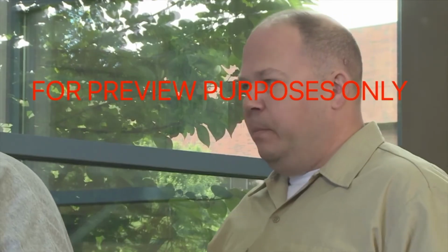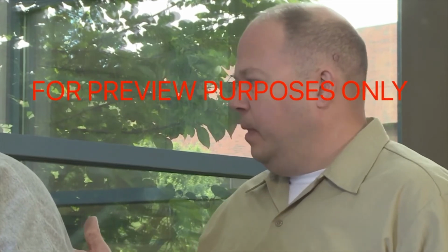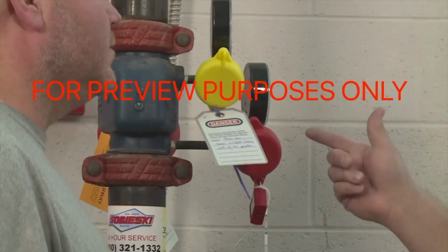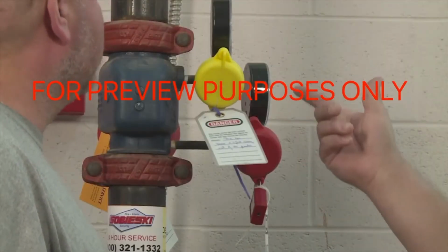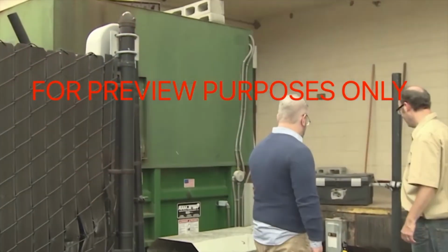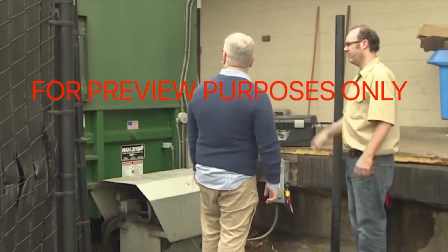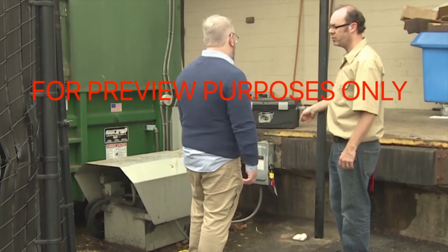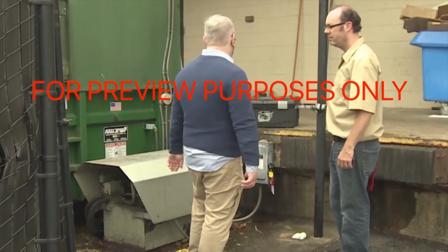Outside personnel such as contractors can also become involved in lockout-tagout operations. If contractor personnel are working in the area, facility representatives need to inform them of any lockout-tagout activities that are going on which could affect them. If the contractors themselves are performing lockout-tagout work, they must inform facility representatives of their lockout-tagout activity.